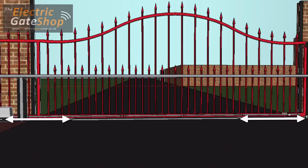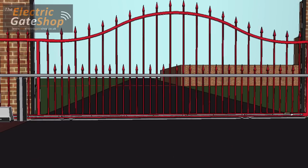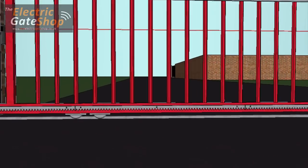This formula allows even weight distribution over both rollers, with bias on each end to stop the rocking effect. On particularly heavy gates, you can fit two pairs of rollers, as shown.